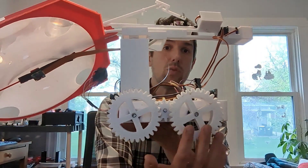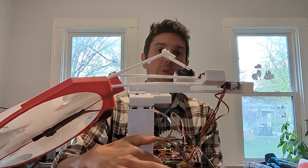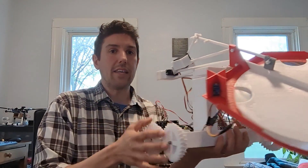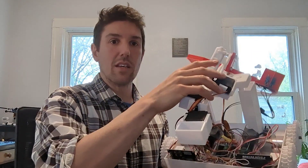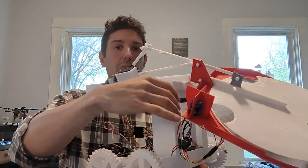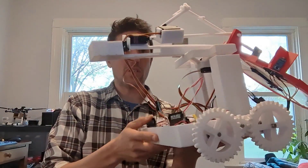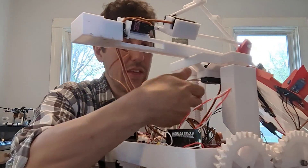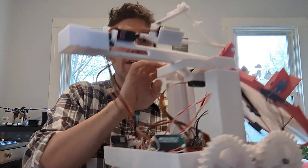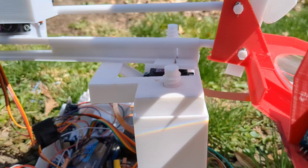Second, the mechanicals. We've got these nice wheels here — this is all 3D printed. There's a little cog in the middle powered by a 50 RPM motor that turns the wheels. Inside the 3D printed body there are housings for all sorts of electronics that control this thing. The body comes all the way up and holds the lens assembly and a bunch of servo motors. These screws are controlled by worm motors right down here, and when those worm motors turn, they take the whole assembly on top and move it up and down. The arms here just keep things from moving around and falling over.